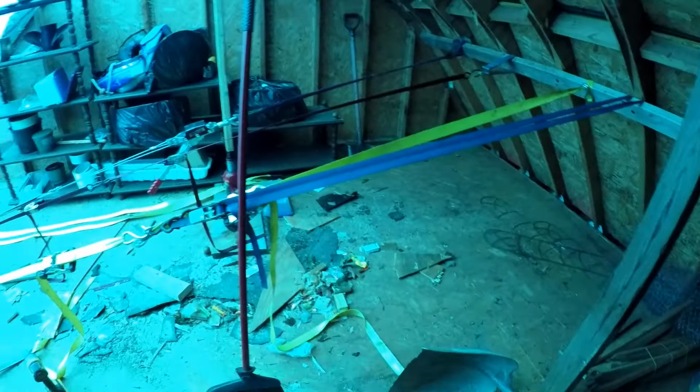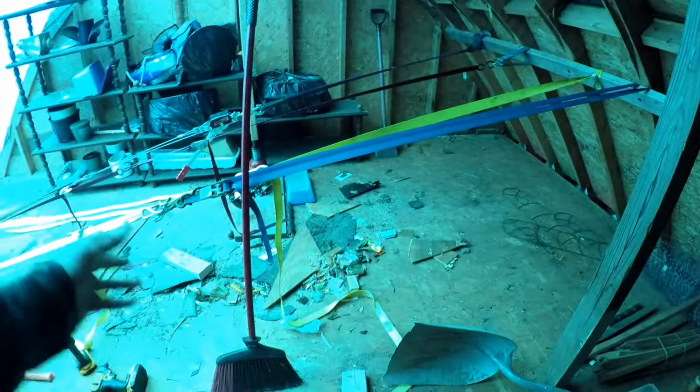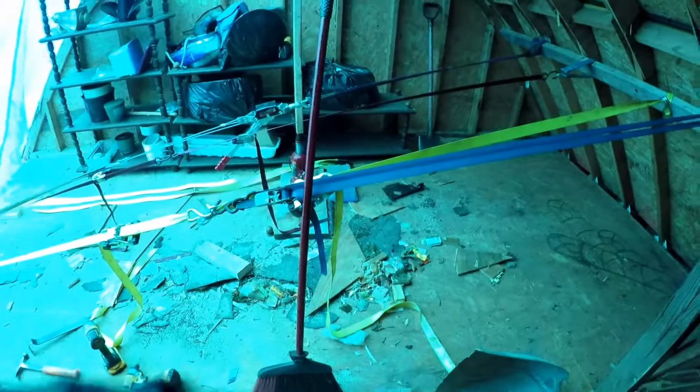I got this floor replaced. Now, the homeowner built this several years ago. He did some construction and stuff. He is much too elderly to fix this now. There's some things that I would have an issue with, but not that big a deal. The OSB he ran was running the wrong way. It's running with the joist, so it doesn't have its strength axis.